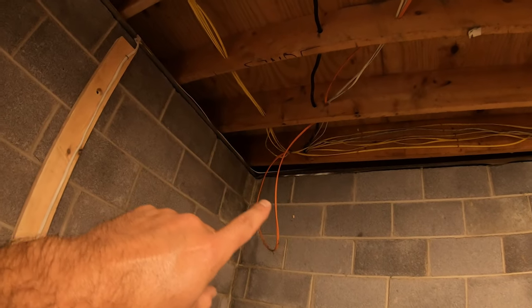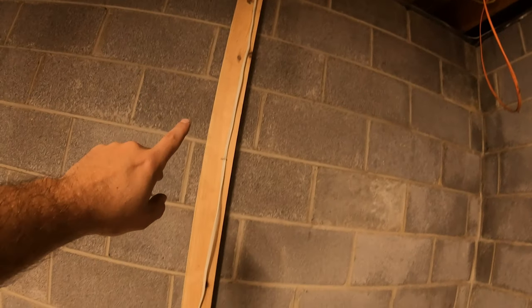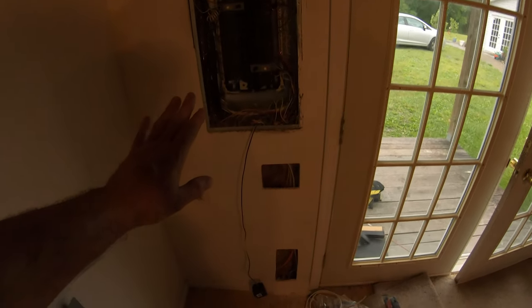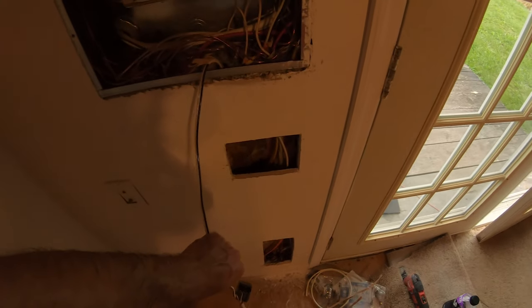All right, we got the supply wire from the panel, the home run, coming down. I put this 2x4 tap conduit to the wall so we had something to connect to. Loops out and into the disconnect out there. All right, so it's the final piece here. I always wait to do this last so we don't have any power going to the unit, nothing gets goofy. So I've got the breaker connected here. We're gonna pop it in the panel, do the little punch outs in there, and this thing is good to fire up. So let's get that done.